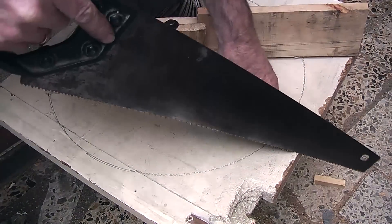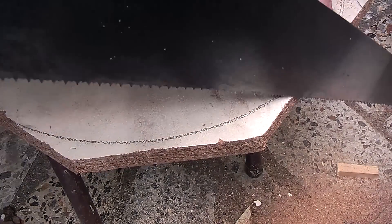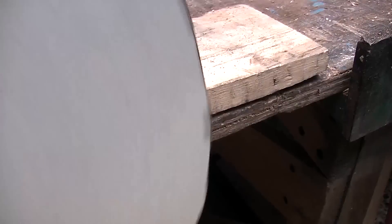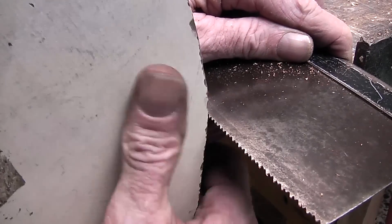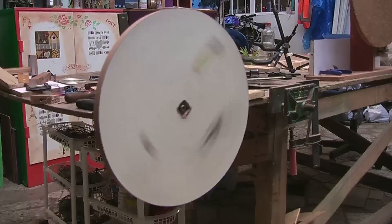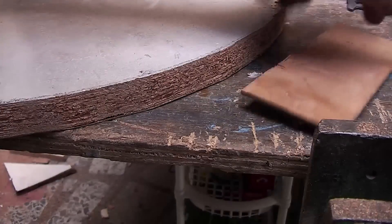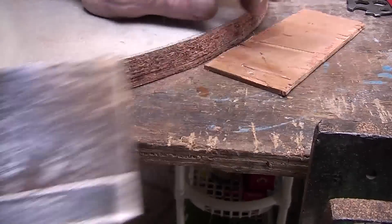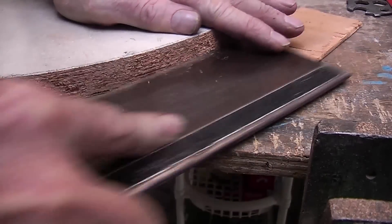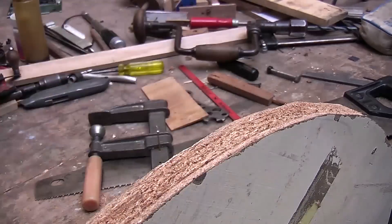Then we go through the task of cutting the circle out — just keep cutting corners off and keep cutting corners off until you have got a circle. Now to true it up a little bit, I am going to put my saw here and then spin it, and just grind off those lumpy bits. So there it is. Then, as with other pulleys, we put a thin piece of board on there and we are going to score a guide line around the whole thing, flip it over and do the other side as well, to cut the groove or the V in the pulley. Then I will cut the groove — put the saw on the 45 degree angle, cut this way, cut that way and go right around to make the groove — and then clean it up with a little bit of a saw.